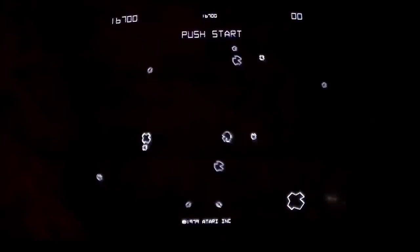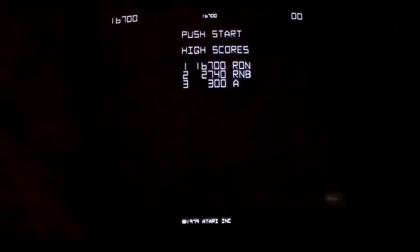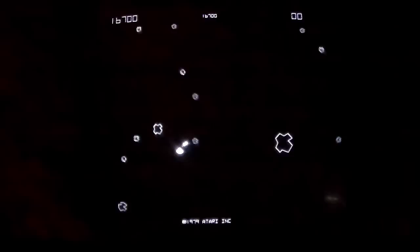I've mentioned this in other videos. These games made analog sounds, or is it referred to as discrete sounds? Basically, the board doesn't have a sound chip that's playing a recording. It creates a sound with waveforms and resistors and capacitors and transistors doing their thing. There's a white noise generator circuit, and then there's sine waves or whatever, I don't know what they're called, that it manipulates by running it through a filter, and it makes a different sound.